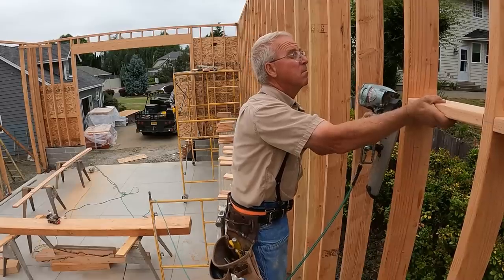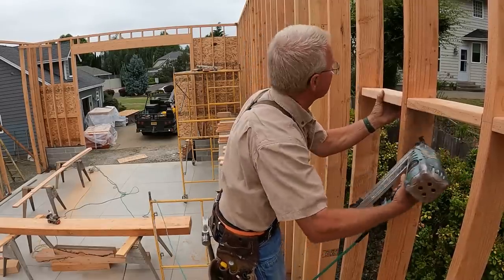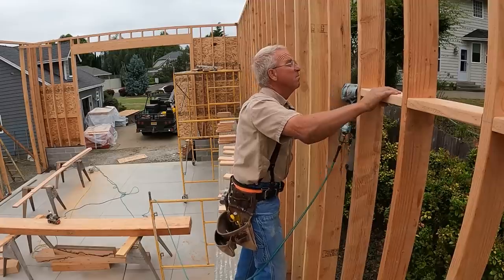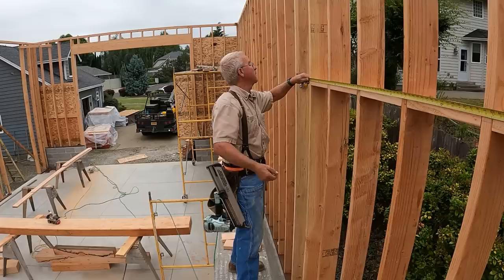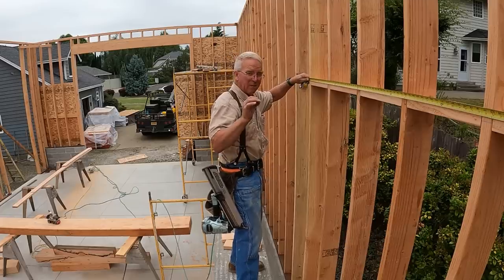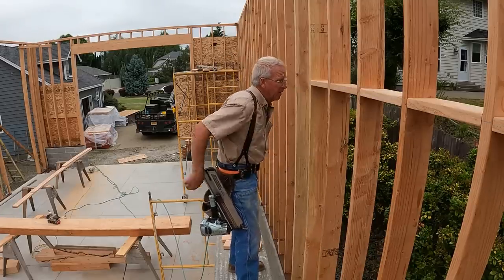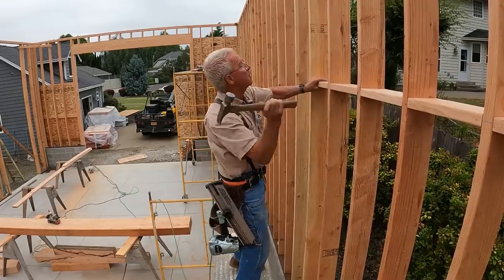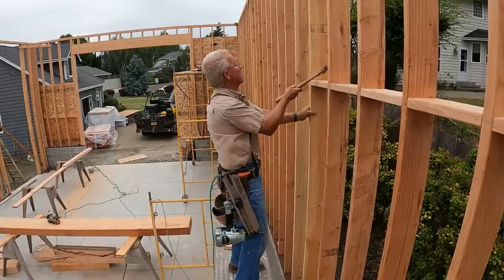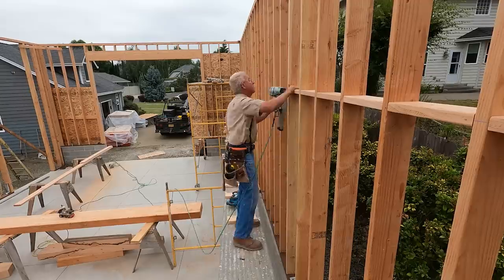So when I'm putting in blocks and trusting the length of the blocks to not accumulate a bow in a roof truss or a floor joist or a stud, I just drop back, hook 5 or 6 back, and check to make sure. Yep, I'm just a little under layout, and a little under layout is way better than a little over layout. So I'm going to loosen up a couple. And keep moving.